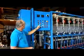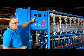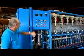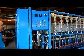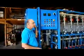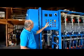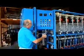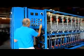So that covers these 2 faults. Feed pump motor fault: we have a contactor in this panel which trips; to reset, hit the reset button. DC power supply fault: any of these 8 power supplies can trip. If any of them trip, reset the contactor in the cabinet, then hit the reset button, and then you're running again. Then we have these other 6 alarms over here. We do have one more fault light.